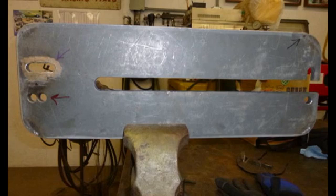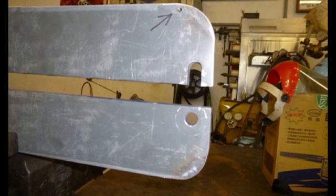This is the basic bead roller mainframe after everything has been removed. After all of the corners have been radiused and ground smooth, I drill and tap a 10-32 hole up in the top corner there for a return spring.